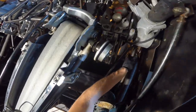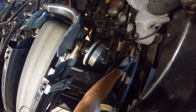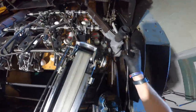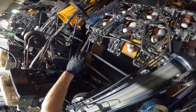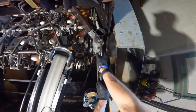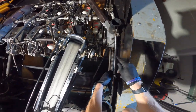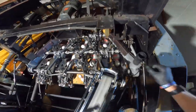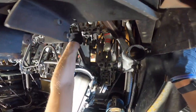The two lower table rods that hold the curtain up move the table front to back and can also adjust the tilt of the table. The top rods are more often used for adjusting the tilt. The key is to keep track of how much you're adjusting each one — I usually take a white marker and put a dot on the top of each rod so I can track how many turns I'm making. You want to turn each paired rod the same number of turns. The top two rods go together, the bottom two go together, and then the ones that control the height — the ones connecting to the four-through-six pin tube — actually support the table up in the air.